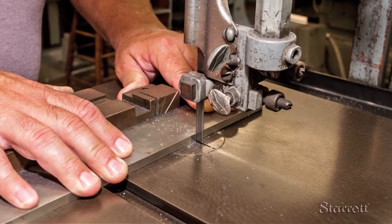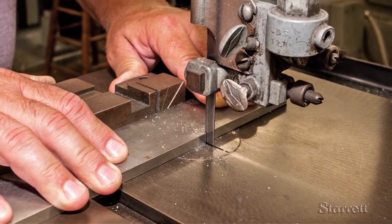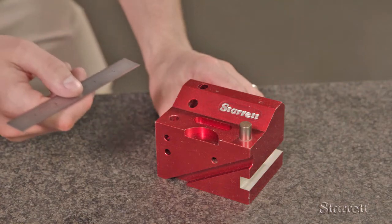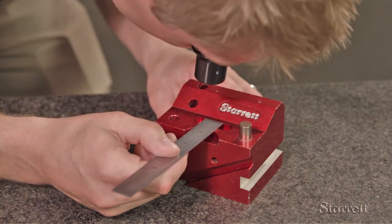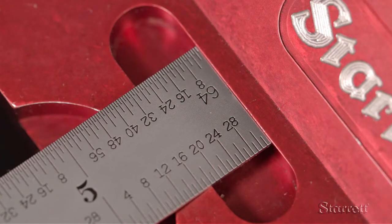One piece of stock — quick, easy, and just the right size. This toolmaker is looking at a slot through a 2x loupe and using the sixty-fourth inch scale to get a very close estimation of slot width.